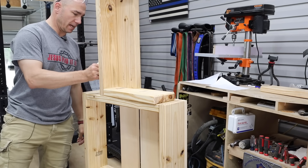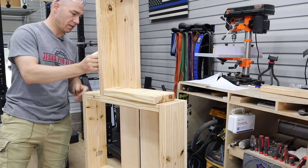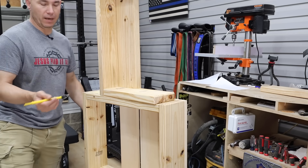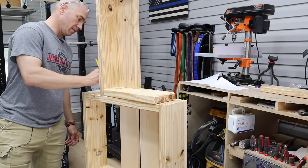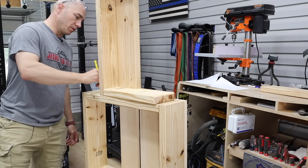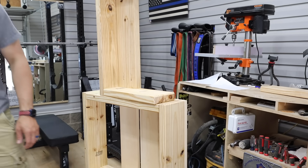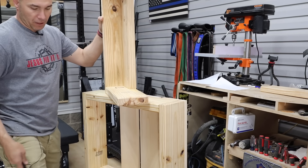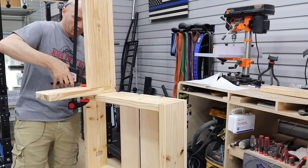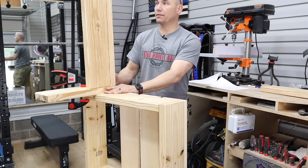So this is the short side. I'm putting glue here where this short leg is going to be attached. If you just want to screw it together you can, but gluing it is going to keep it from squeaking later as the wood expands and contracts in the weather. Even if you've got it stained, it's a great idea to go ahead and put glue on this thing. I went ahead and rounded over those bottoms of this leg too. The main thing you're looking for is you want to make sure this top side is flush and this backside is flush.